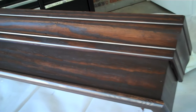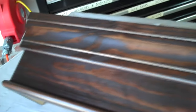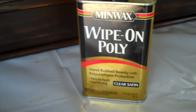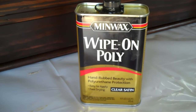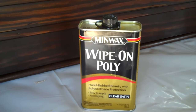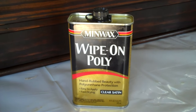I have finished putting the two coats of the General Finishes Java Gel Stain on this piece, and it has come out just like I wanted to. It still has that beautiful wood grain showing, but has some nice, rich coverage. I've also already put one coat of the top coat on here. For this project, I like a wipe-on poly — I think that it just makes the project a little easier. And for this one, I did not use the polycrylic; I went ahead and used the regular polyurethane, primarily because it's going to be in a very wet environment — it's going in a bathroom. Sometimes I feel like the polyacrylics, when they're around a lot of moisture, may not hold up quite as well. So, I like the satin, and I like a wipe-on poly, and I will finish with three coats of this.